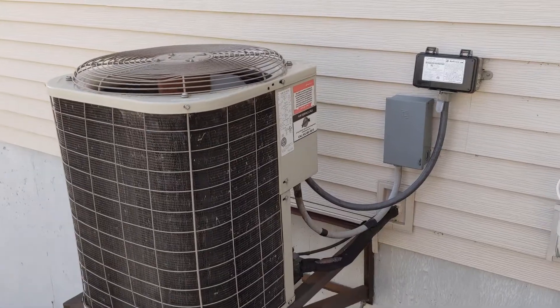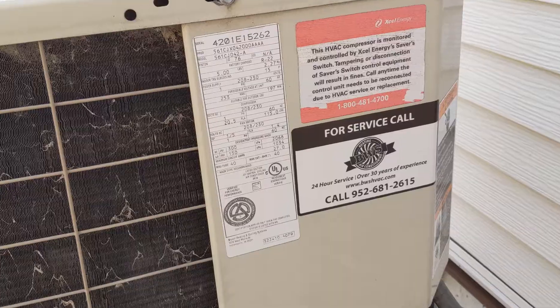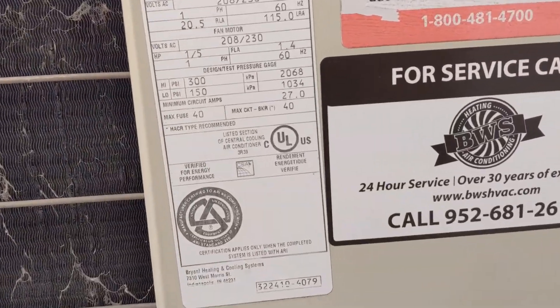For an air conditioner, it's super simple. You can forget all the stuff that you've memorized — all the charts and all the different stuff for sizing and ampacity. All you need to do is look at the data plate on the air conditioner compressor unit. On that data plate, it's going to tell you the minimum ampacity of the wires going into the unit. Then you turn to your chart and make sure that whatever wires come into the air conditioner match this number.